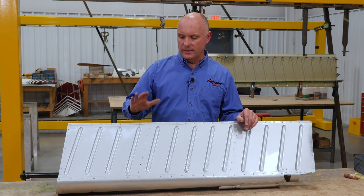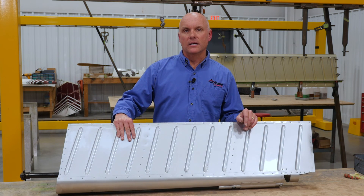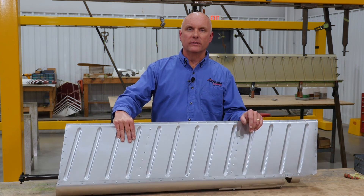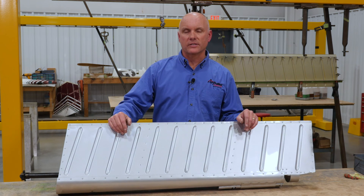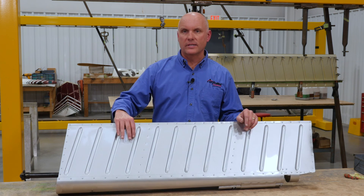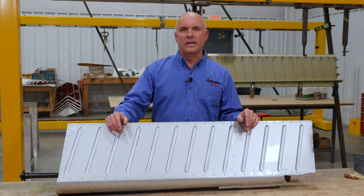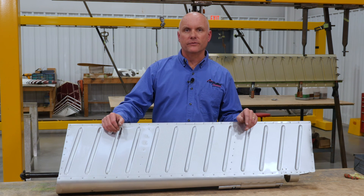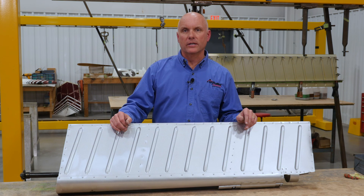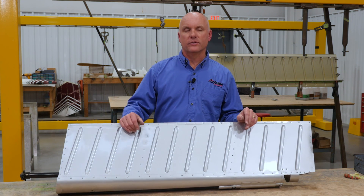We still sometimes see cracking in the dash-26 rudders. I would propose that some of that is due to mishandling — pilots grabbing onto the rudder during a pre-flight and moving it back and forth, putting undue stress on the skin. I would offer a cautionary word to pilots: maybe don't move the rudder back and forth quite so hard, and don't grab onto the rudder skin quite so forcefully. Another theory is that the PA-32 series aircraft being heavier and faster may contribute to cracking of the trailing edge flutes. Regardless, the dash-26 rudder seems to be a more permanent fix with the heavier trailing edge and the extra structure inside.